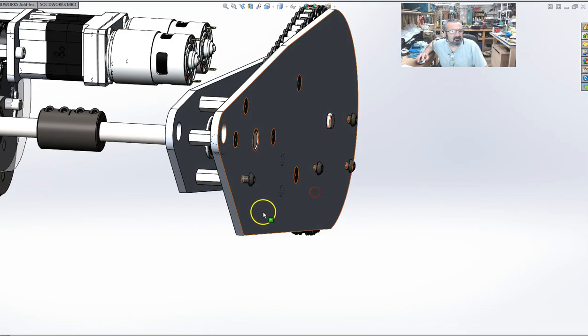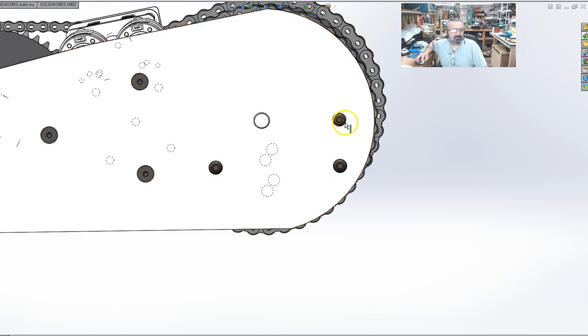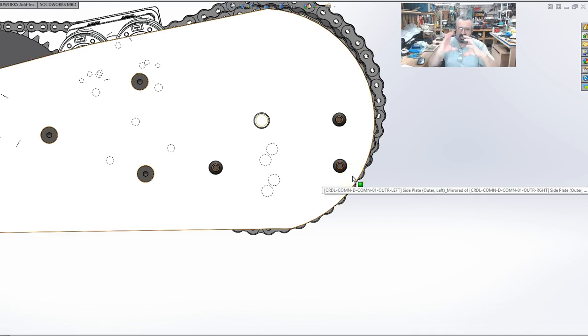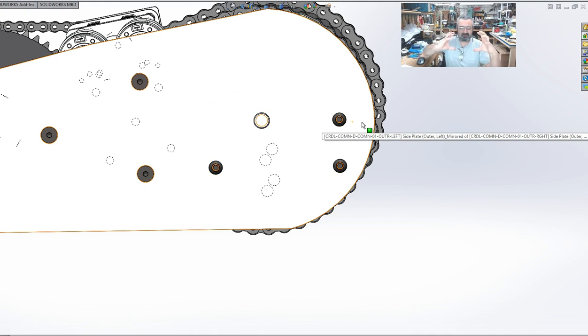The back of the plate is held coincident to the cradle base side plate by this through bolt here, and then there are some torsional bolt screws that I put through here that will absorb the load, because there's a lot of pressure, guys. We're talking hundreds and hundreds of pounds. This thing may want to try to go up or down on us. That's what these 3 button head screws stop. The whole thing's rock solid.